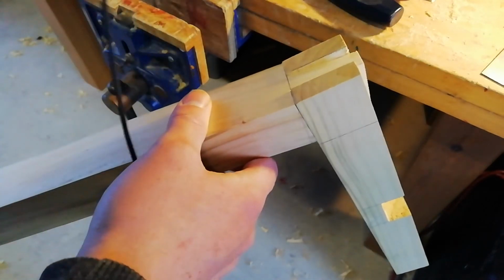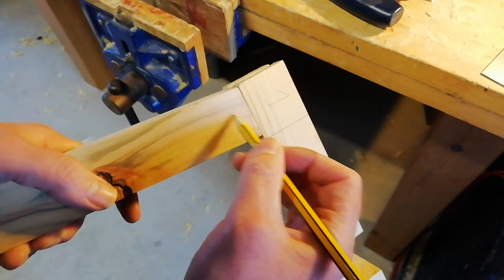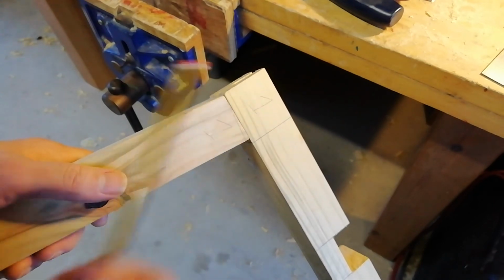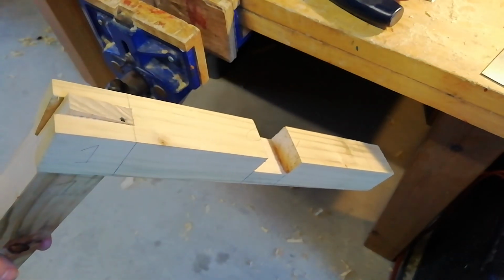One last important point we want to make before we finish up on this joint is to number your joints. So this is joint 1, joint 1. Okay, so I can't get things confused when I go to glue things up. Now to simply repeat the process another 4 times for each one of the legs. In the next video, we will turn our attention to making the seat that will go on top of our stool.